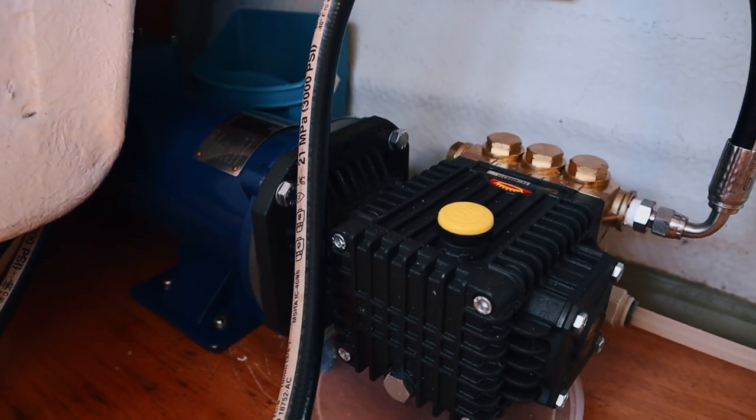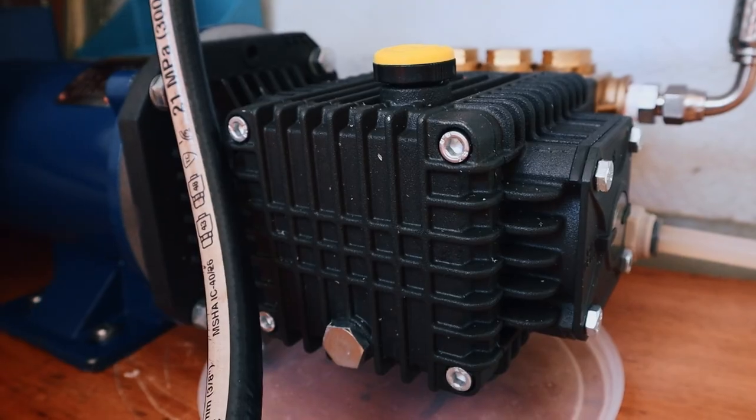This wouldn't be a real honest review if I didn't tell you about some of the cons of the system. First, it takes more power than a Clark pump, which you find on a lot of off-the-shelf systems. For our part, our electrical system can support our watermaker easily, so this really isn't a problem. Next, some people may find the system a bit noisy, but no watermaker is silent and it does not run permanently — just a few hours every few days.